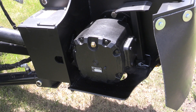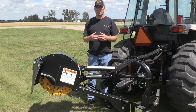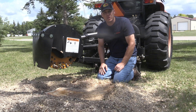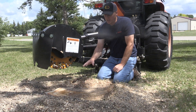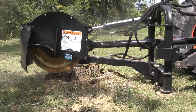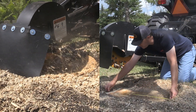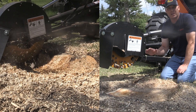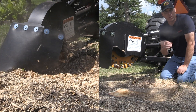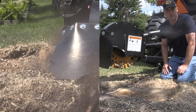The gearbox is a very large heavy-duty gearbox with a flange mount — we're not using a hub style mount because the flange style is much stronger. I wanted to show you why it's so important that you have a stump grinder with a really wide swing arc. This box elder stump was only about 16 to 18 inches in diameter at its top, but once I got below grade, the width here is over 34 inches from side to side, and I'm able to take that in one complete swing or arc of the cutter. That really eliminates the amount of time needed to move and make multiple passes, making you a lot more productive.